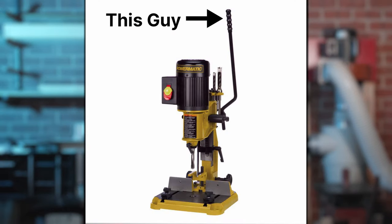Unlike just using a forstner bit on a drill press to create a mortise, you can much more easily step over your mortise to create a wider one, whereas a forstner bit will tend to grab unless you're doing that exact width. I'm back home now, and for context, this is now being recorded during plague times. There are a few downsides of the hollow chisel mortiser for drill presses to be aware of. The major difference between a drill press and a hollow chisel mortiser is the arm that moves the quill. With a standalone mortiser you have much more mechanical advantage, so it's easier to plough through the material. Without that on the drill press jig, you're going to struggle with denser hardwoods with larger chisels. The auger removes the majority of the material, but you still have to contend with pushing a chisel using a handwheel — no percussive assistance.